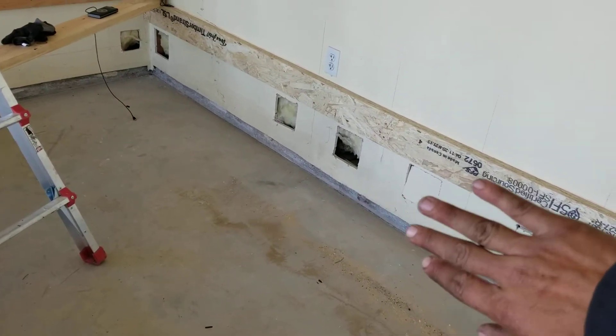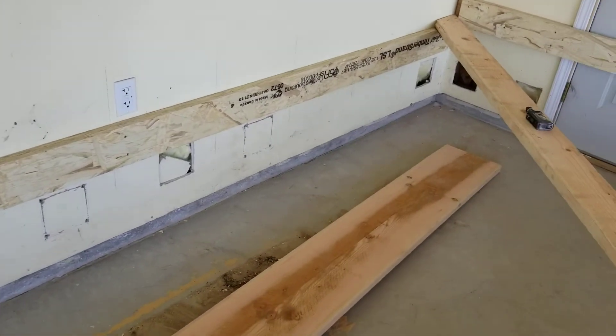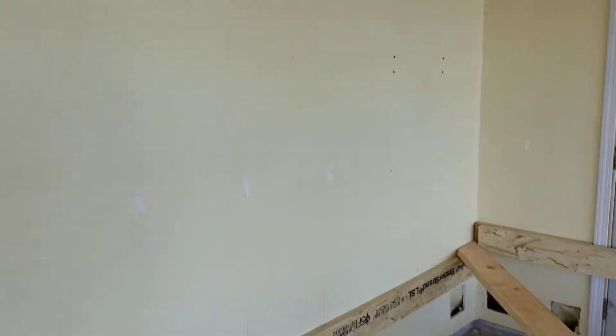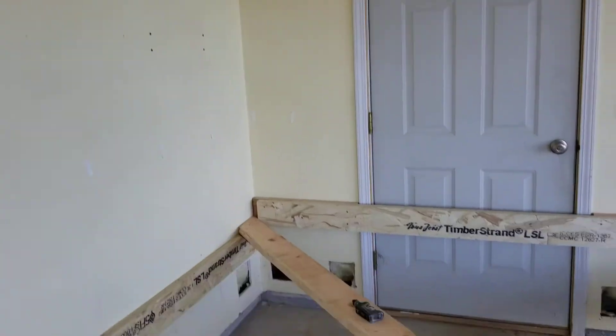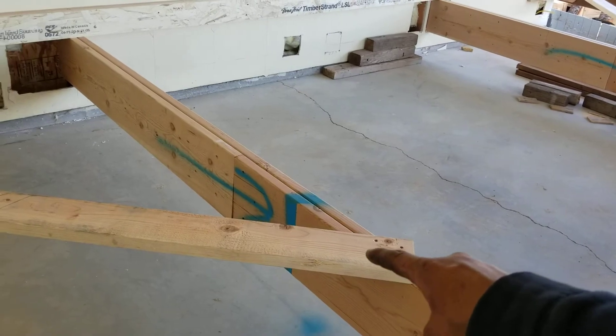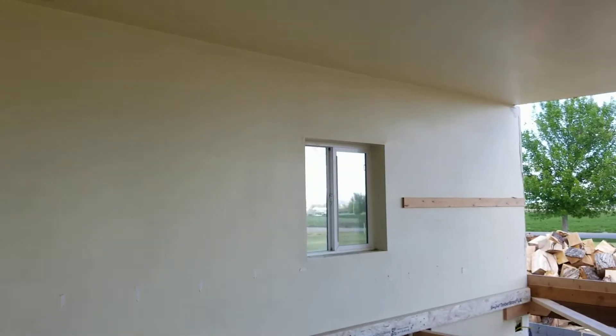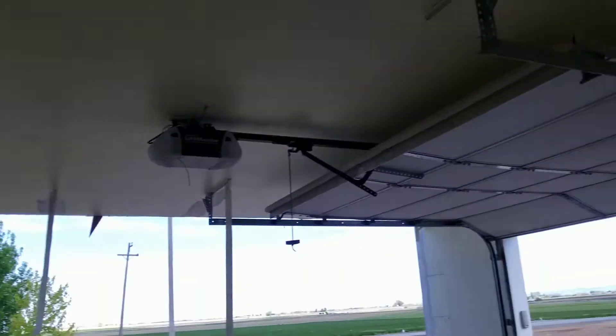There's not going to be too much additional support on this wall. There will be another 2x8 attached flat on the bottom of this wall, screwed all along the sill plates. Then there's going to be more 2x6s coming down from right where the trailer joins, going up and connecting to some wood we're going to use along the top of that corner to help support the roof.